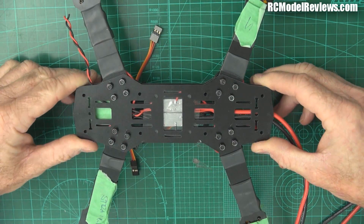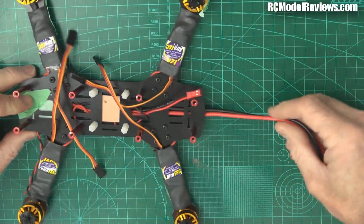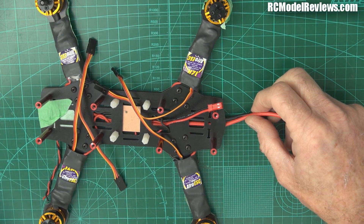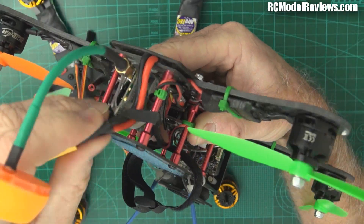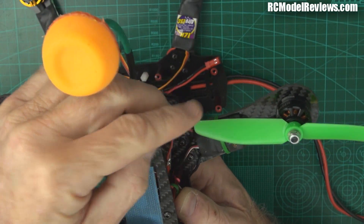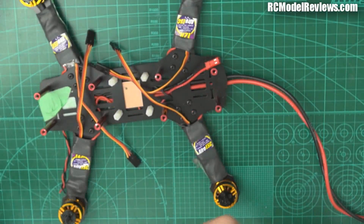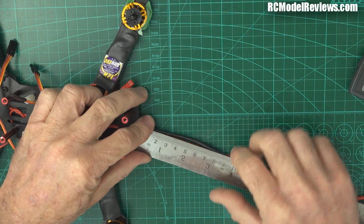If you do that, I'll let you know whether I've run out or not - just a little thank you to all those people that watch these videos. Next step is we're going to put our XT60 on here. A lot of people make this lead really short - I don't, because if you make it really short it's actually more difficult to keep the battery lead out of the prop than if you make it longer. When you make it longer, you can put a rubber band around it to hold it out of the way. If you rubber band the battery lead to one of these posts, then it's well out of the way and doesn't fall into the props. The number of mini quad batteries I've seen with big chunks out of the insulation because they've fallen into the props is ridiculous.